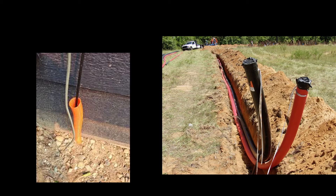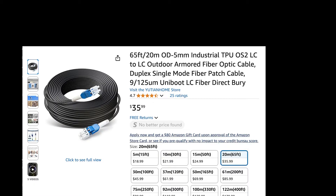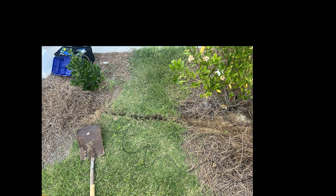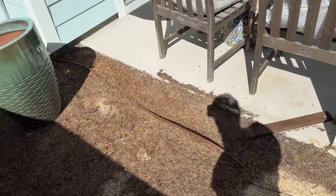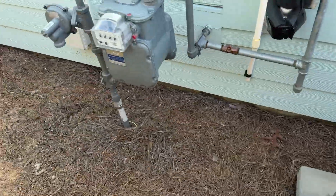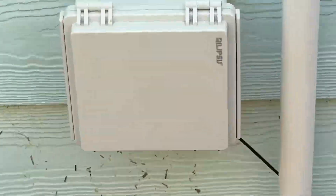The right way of doing this is to bury a conduit — a tubing — or you could run the fiber through the same conduit as your power cables going from the house to the garage. I don't really have the time right now, so I'm going to be using this direct bury fiber that I got off Amazon. It's in a black jacket, it's meant to withstand the elements. I got an edger tool from Lowe's to make a bit of a trench across the grass, and from there I just tucked it in against the foundation from outside. The important thing I'm talking about is running it in sections — you want to have separate fiber cables going to different areas.